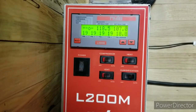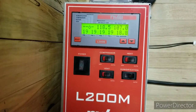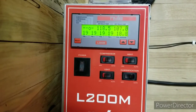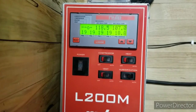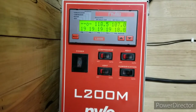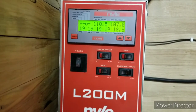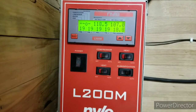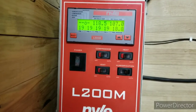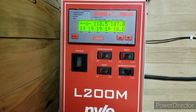So far I'm pretty happy with it. Right now it's just operating with the compressor and five fans. In my area, electricity costs 9.12 cents per kilowatt-hour, and my Sense Energy Monitor is spitting out a figure of 41 cents an hour for operation costs based on just the compressor and the fans.